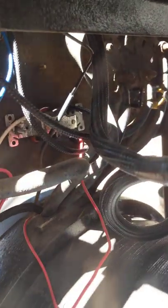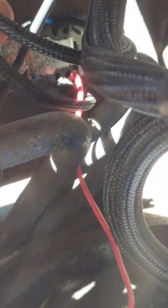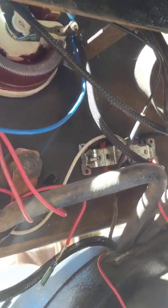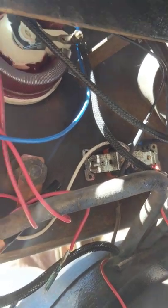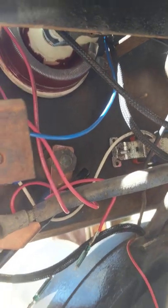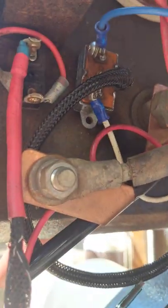From there we go into the outlet you can see there, and then from the outlet it goes to the rheostat. The rheostat controls the power that's going into the second series - your generator housing shunt coils. The wiring goes from the outlet on the negative side to the rheostat, which then controls the power that comes and goes to the three-way selector here for a remote.